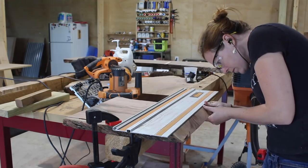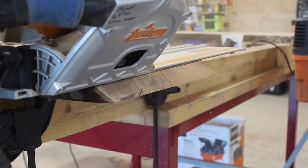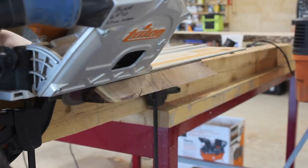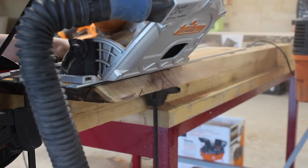The important thing about this second cut is to take off as little material as possible from what will be the outside exposed grain. I once again used my track saw and took my time lining up the track as close to the peak of the cut as I could possibly get it, then took this in three passes as well.